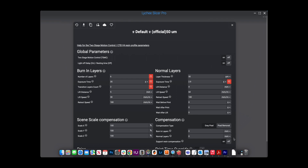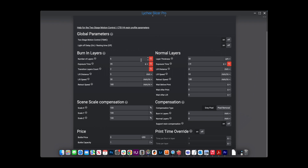And that's really all the settings you need to get your first print going. You can fiddle with the base exposure time and the exposure time — those two are the biggest culprits for failed prints. People often don't set them correctly, or they'll use an exposure time found online like 1.5 seconds, which may look fine on an exposure test but won't translate well to real-world printing.